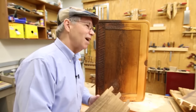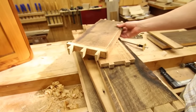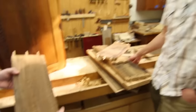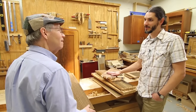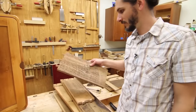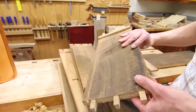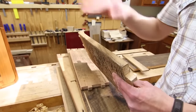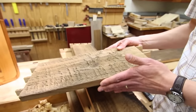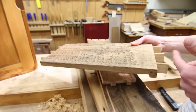The joinery has got to be difficult because you've got dovetails and tenons for shelves — and this is not a great surface to register off of. That's another joy in working with old wood — it's a little bit of a challenge, and for me that's the fun part of problem solving. You can keep this exterior surface just by creating some reference surfaces to cut square joints. For example, this back edge that won't be seen would be against the wall — just make sure you have a nice straight back edge. Joint that, then use it against your fence to cut a 90-degree angle on the other end. Then you have a square back edge where you can lay out and cut your joinery.